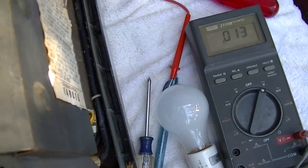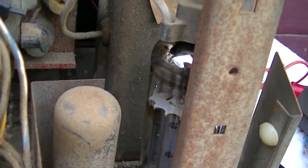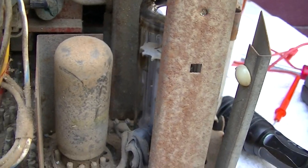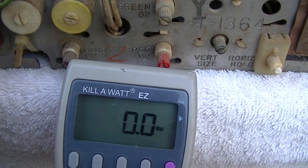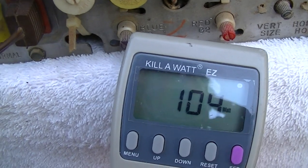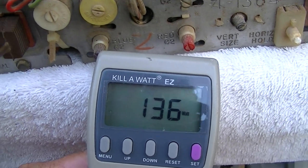I just want to make sure before I stick another tube in there that one of these snubbing or bypass capacitors isn't shorted. I don't know if it's good. Used, looks like a Japanese made 20LF6. Here we go. Looks a lot better. So basically the filament string in this thing is 80 or 85 watts. Wow, that's incredible. That's an incredible amount of heat.